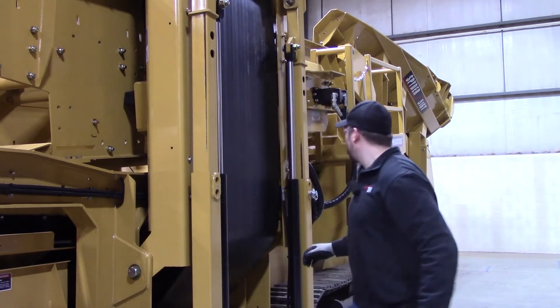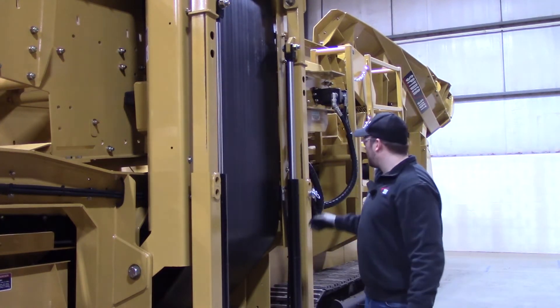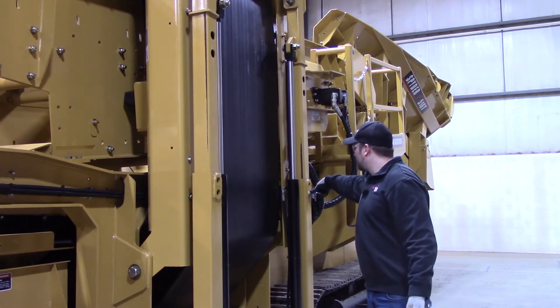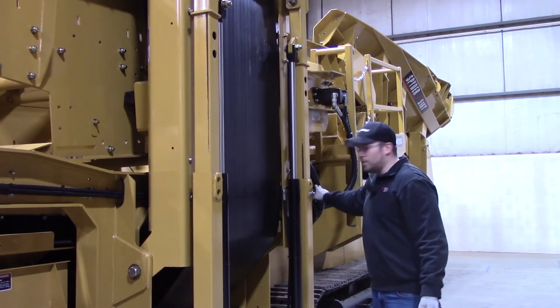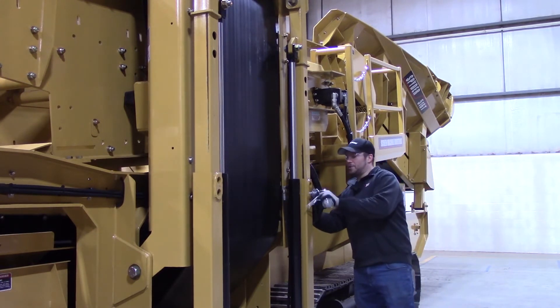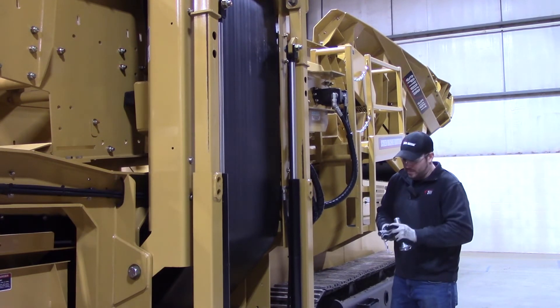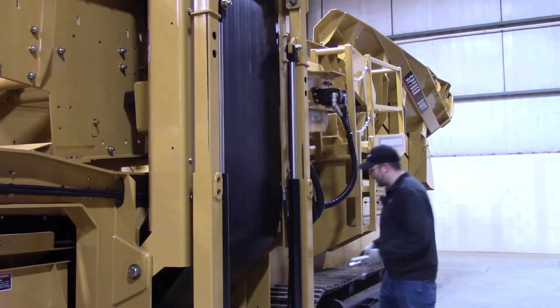Just take your keeper like that. This one's actually a little tight, so I've got Mark over there working the handle on that cylinder. Just work the cylinder until it loosens up, just like that. Don't go any more than you need to — you'll either need to extend or retract the cylinder just to loosen it up. It just depends on how it was put away, the pressure on it, how long it's been sitting, anything like that.